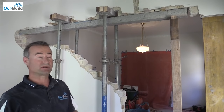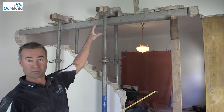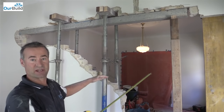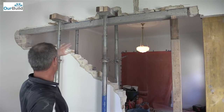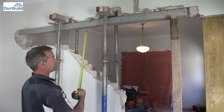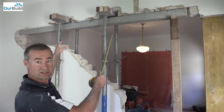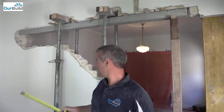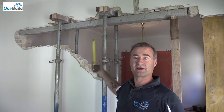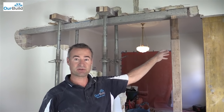The big secret with this wall removal is getting the needles in through the wall first. The reason we put those through is to take the weight of the wall above — by putting those timbers and props on the side of the wall and winding them up, it takes the load off. Then you can start taking bricks out from below. I don't like to take too many bricks out until we get the concrete lintel up there. We've slid the lintel up into place and put wedges just under each brick anywhere it's not supported to take the weight above. We've got a temporary prop on one side. After lunch we'll pull down all this brickwork, put another prop in the corner, take the wedges out and wind it right up tight underneath the brickwork, then brick in the corner under the lintel so it's load-bearing.